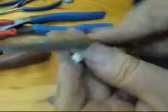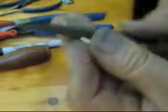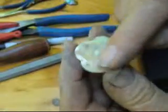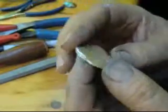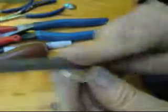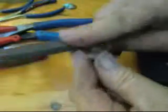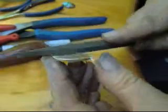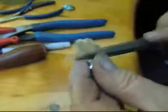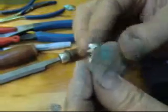Come in and go ahead and do a little bit of filing on the back side of this. Now the back side, you know, it always tends to warp a little bit when you heat it up, pretty much with it, all metal. Notice how it's really shiny around the edges, but right in that center it's a little bit dipped in. If it's really bad, you can come back in and bang it out a little bit and then file it down, but in this case, it's probably good enough to go ahead and I'll just do a little bit more filing, see if we can get it down a little bit. And then just go ahead and come in and buff it. But we are going to do all of that a little bit later.